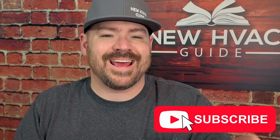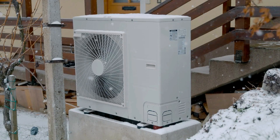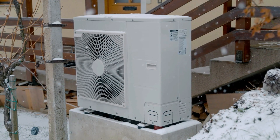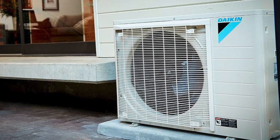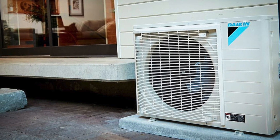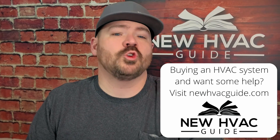If you have a straight AC outdoor unit and you're wanting to upgrade — say, go with a heat pump to save some energy — there are so many options out there, so many cool types of heat pumps, and so many ways homeowners can save a ton of money if they upgrade. But again, your options are limited if you only have two wires running out to that outdoor unit.